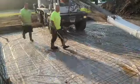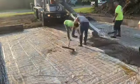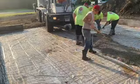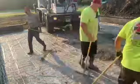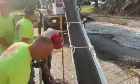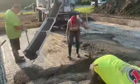Hey guys, Bondo here. So we're finishing up this little Nudura project, that series that I was doing, and I'll walk you through how we're pouring the floor here. Like, we put a wet pad down the middle. You can see we got the screed stick, and we just flattened it out. Now we're just going to fill this concrete in, and we pull the wire mesh up.